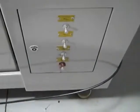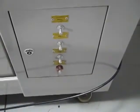It does have a UPS right down below here. It has an accessible tray here and another tray down by the bottom of the fluxer. It has another filter right up above the fluxer. It has a trap door which gives you access to all the pneumatic controls that control the fluxer pressure and speed. Right back around this side, we have the pneumatic input, and that's pretty much it.